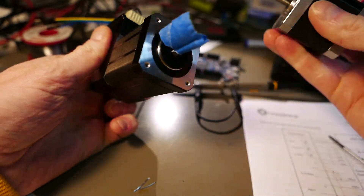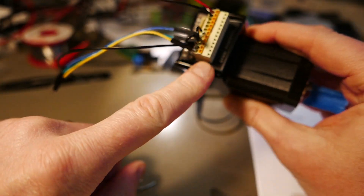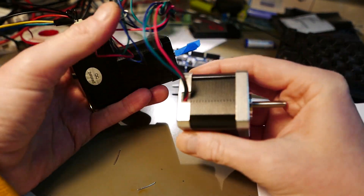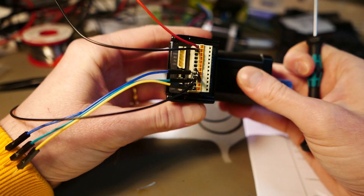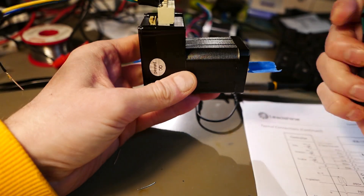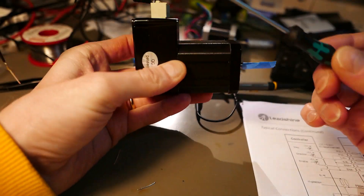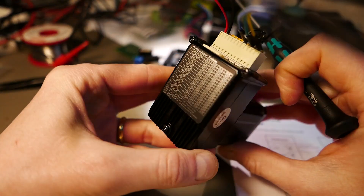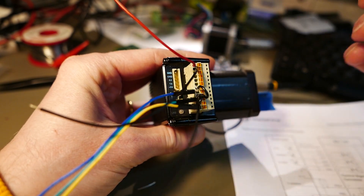So how is it different from the usual stepper motor? Both of them are NEMA 17, by the way. The interesting thing with this stepper motor is that this one can be driven with a normal TTL signal — basically you can drive it with an Arduino — whereas the other one has to be driven with higher current, so you have to connect it like a stepper driver. This one has very advanced properties. The good thing is that it's like a wannabe servo, because it has an optical encoder inside.